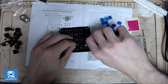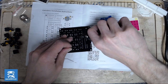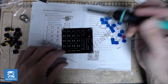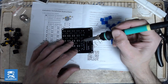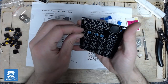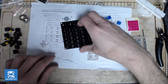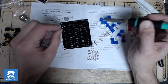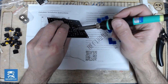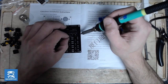Yeah, and to be honest with you, what people don't realize, and I sometimes watch YouTube videos of people doing PCB stuff, it kind of makes me cringe because they're running their irons just above the melting point of the solder. But that's not how these things work. You've got a lot of heat getting dissipated in the PCB and the components. Your iron's basically going to run cold, and you can see them doing this cold soldering, pushing it around like a bit of molten lead, and you're like, ooh, don't do that. And then people go, oh, but you're going to damage the components. It's not like you're hanging around. Bang, you're done. There's not that much heat that's gone into that component, but you've got a pretty good joint. That's what you're aiming for, a good joint and saving time. Yeah, good joints always the target. There you go. I know you're always up for a good joint.